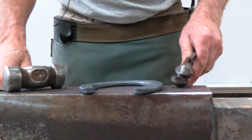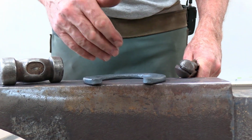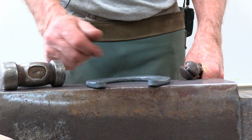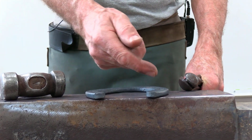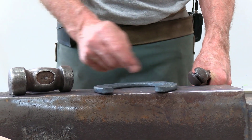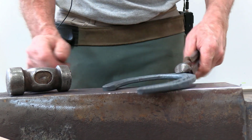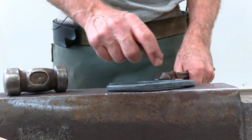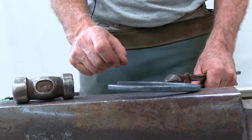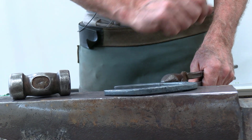If we have to, we can apply a shoe that's got contact in the toe and good contact in the heels, and we may have a gap in the branches, but we don't want to put a shoe on that has no contact in one or both heels, or is missing a lot of contact in the toe. If it's missing a lot of contact in the toe area, as you nail the shoe on and block your toenails, it may lift the heels off the heel of the hoof, so now you have sprung heels, even though the problem is really in the toe.